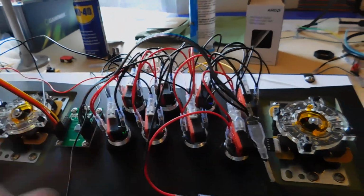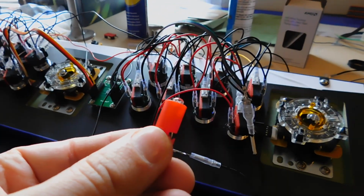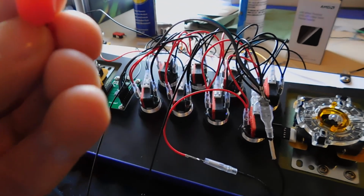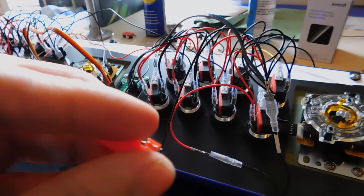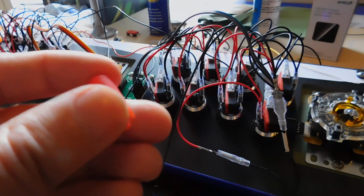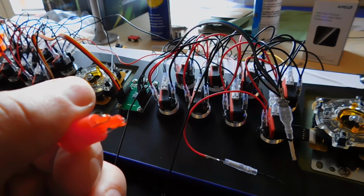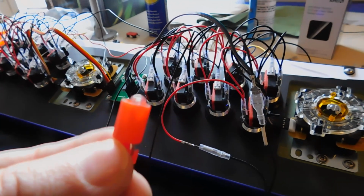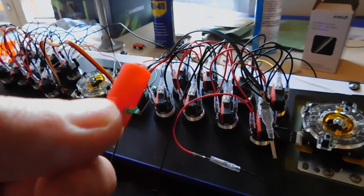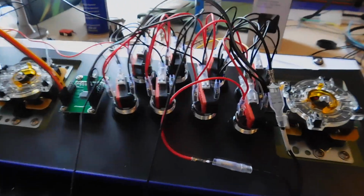the wires are moved. Sometimes these simple bulbs can go, some can be intermittent. I mean, they're simple to replace, it costs pennies to replace also. Sometimes on the inside of the bulb you have the two pins coming off. You have one side which is usually the resistor, I think, on there, and then that sometimes just breaks away. I think they're from China, so they haven't really soldered them properly, so I just go in, resolder them. If that doesn't work, then I just chuck the bulb away and replace it.